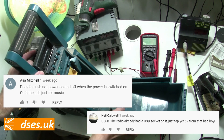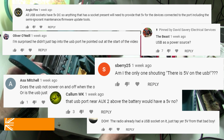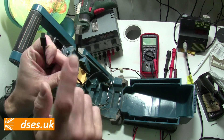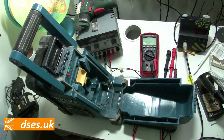Several people asked why I didn't tie in to a 5 volt line of the micro USB port on the rear. Well, I can confirm there is no 5 volt source there. This port is for firmware upgrades, not to connect your MP3 player or to charge your mobile phone from. I assume that if you wanted to upgrade the firmware, you'd connect a laptop via a USB-A to micro USB lead, and the laptop would provide the host voltage. It was also suggested that perhaps other elements such as the display backlight or the radio tuner may be running from 5 volts, and perhaps so. But having spent some time probing around, I went instead for an 18 volt supply point, which was stable and, just as importantly, had solder points big enough for my cack-handed soldering efforts — those points being on an electrolytic capacitor, which is also a component I could easily source and replace, should I cock things up with my ham-fisted efforts.